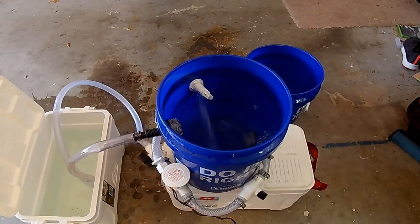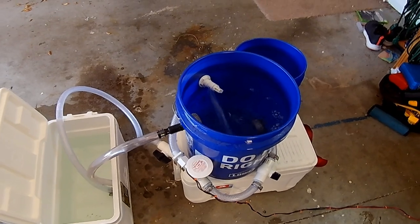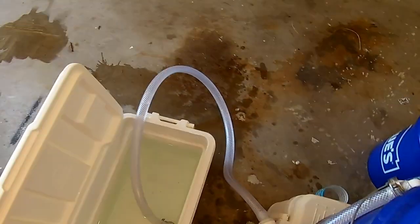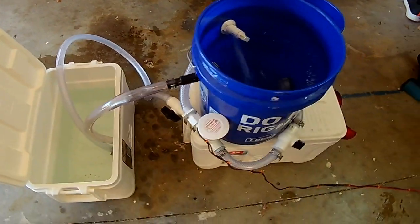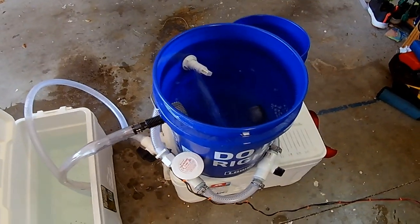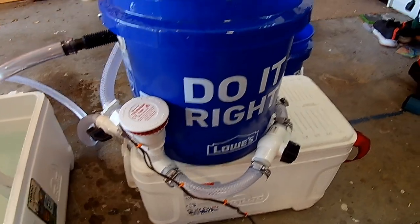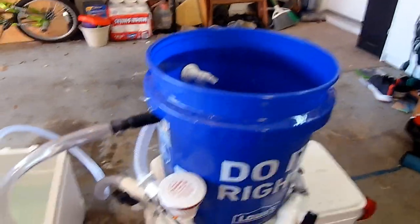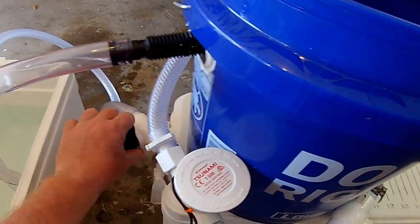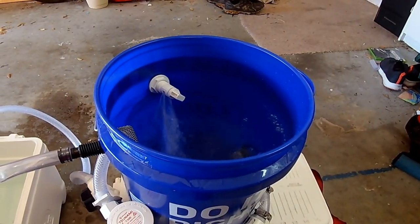One problem I did notice with this particular pump is it does not have enough power to just throw the hose over and it starts sucking the water up. You actually have to prime your raw water hose. It has to be a completely closed system with no air bubbles in it, or it won't pull the water from the bay. So what I've got to do is fill that hose full of water, make sure the whole system has water in it, and it works like a charm. So then when we start running again, we can close the exterior, open up the interior, and now she's rolling.